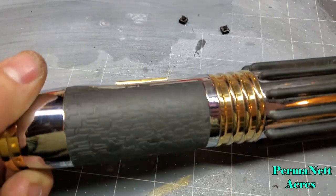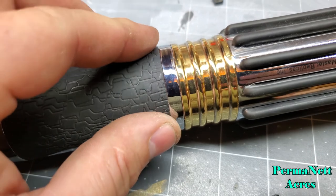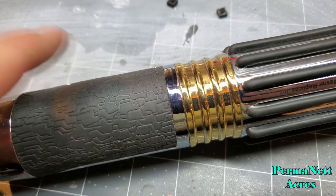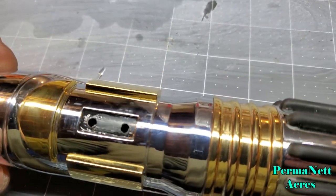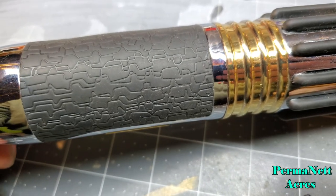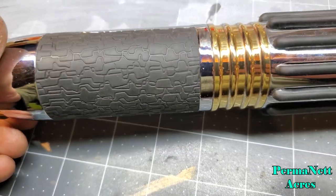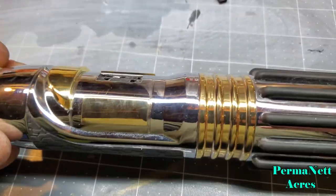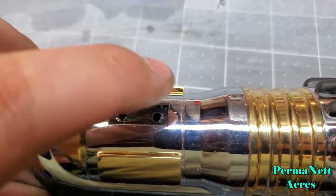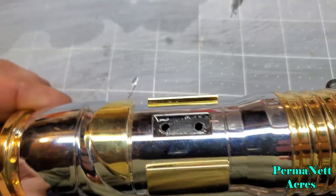So I ended up peeling back this cover right here, and then revealed where the hidden screw is, right here. I drilled a hole in this plastic piece of the chassis, which you see right there where I drilled the holes in, and then put in a 6/32 set screw. So I drilled a hole, tapped it, and threaded that in there, drilled out these holes. I did put some bonding around this to make sure that this doesn't rotate or anything.